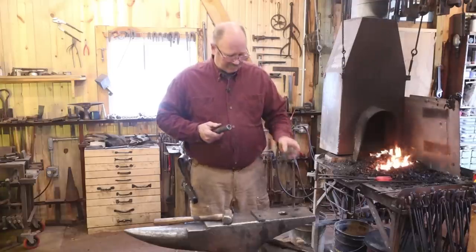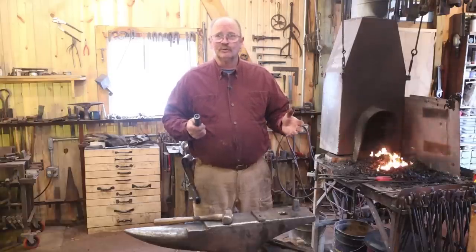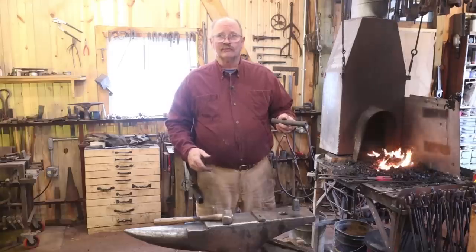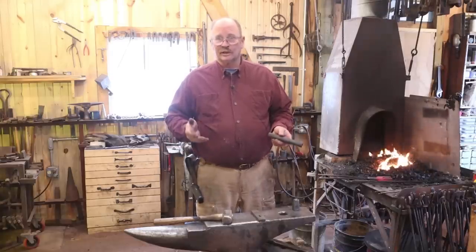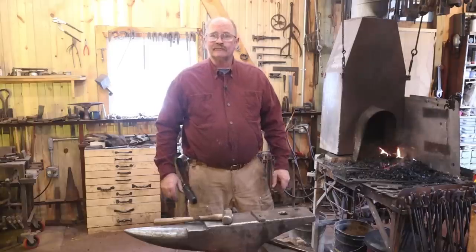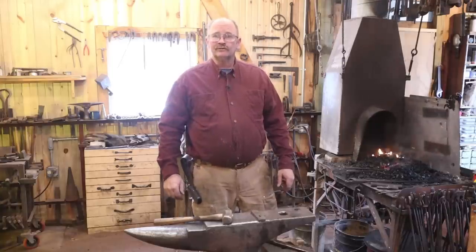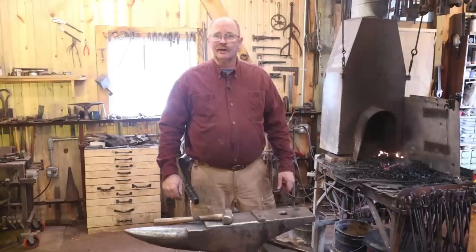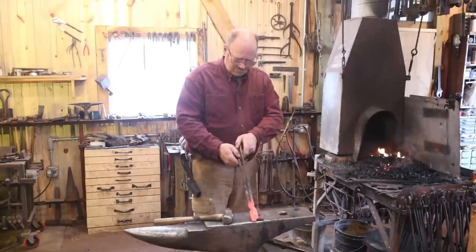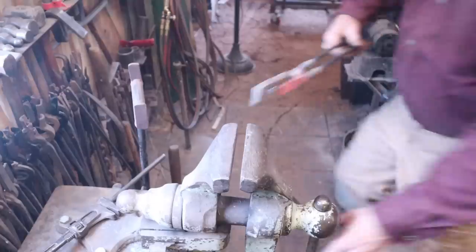Making a pair of tongs really was not the intent for this video — that's just something that needed a rivet in it, so it was a good way to try out our rivet setter. And I am very happy with the way this pair of rivet setters function. Good tools — these will last a lifetime. Make them out of decent steel and you'll never have a problem with them. If you just need them for a temporary use, you could make them out of mild steel. But if you're going to take the trouble, you might as well make them out of something like 4140, or even S7, which would be a really nice steel for this. Anyway, I hope you enjoyed that video. If you did, give it a thumbs up — if you haven't done so already, I would love it if you hit that subscribe button. Feel free to watch some of the other videos, share the videos with your friends, but then take time in your day to get out to your shop, make something, and stay safe. Wear your safety glasses. We'll see you for the next one.